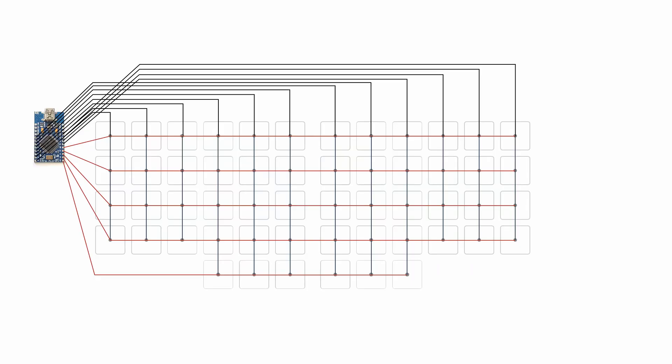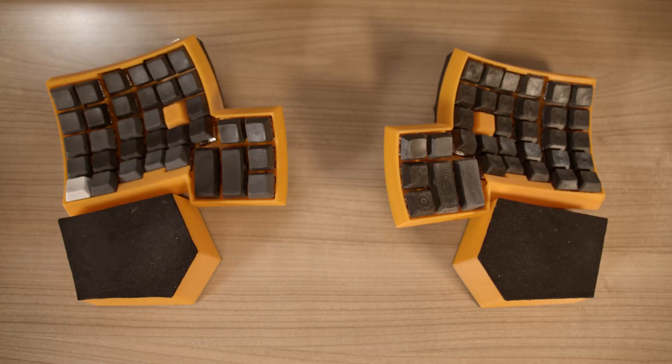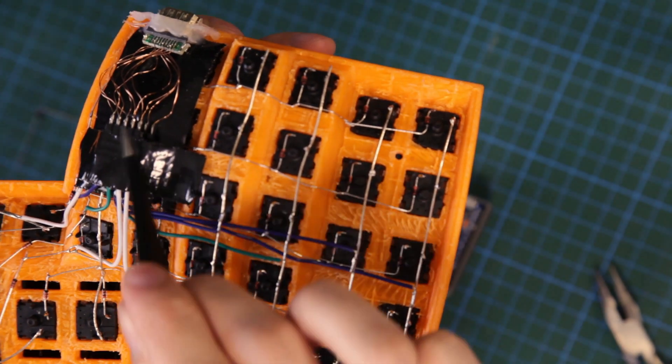But a bit of background first. The halves can be attached in different ways to one another. The first way is direct wiring, which is basically a normal keyboard with a long cable in the middle. This design only has one controller and it's how I built my first keyboard. But you need to have enough data lanes for the columns and rows to connect, which might be a problem. Last time I used an HDMI cable which gave me 14 data lines. This is also a hacky approach — 2 out of 10, would not recommend.